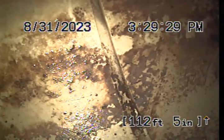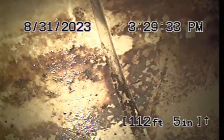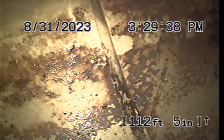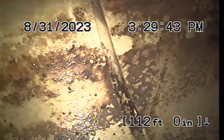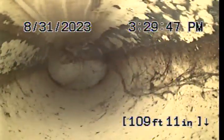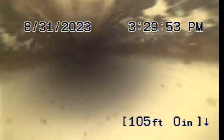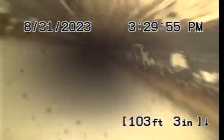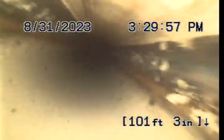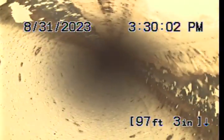What we saw was a new plastic sewer pipe. Nothing remarkable about it — it seems to be functioning just as intended. It's kind of new; it's just under 30 years old. As you can see, I've got my camera sitting at the city sewer, and we're going to pull back into the customer's private line. It is 4-inch PVC. The bottom of the pipe is the top of the screen from this perspective. It's going to be a pretty quiet video inspection — there's not much that's remarkable about the line.